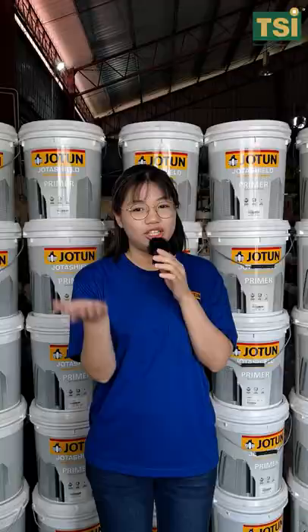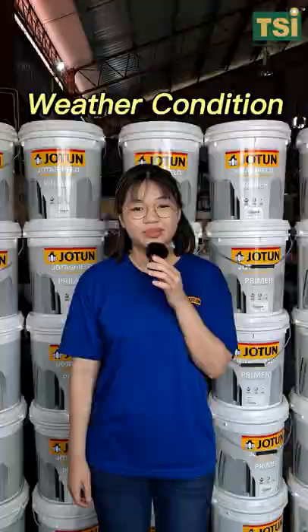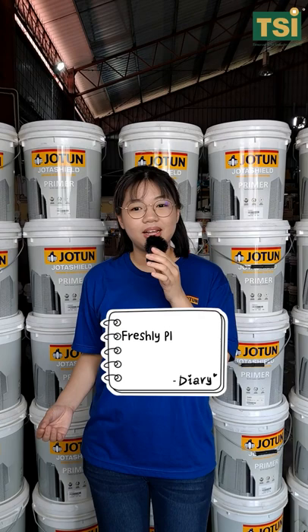It's the timing to apply them on the walls. Jotun Ultra Primer can be applied on a freshly plastered concrete wall in just 3 days, if the surface is cured under good ventilation and good weather conditions. As for Jotashield Primer, before we apply it, we should let our freshly plastered concrete walls sit for approximately 28 days. So the main difference is 3 days versus 28 days.